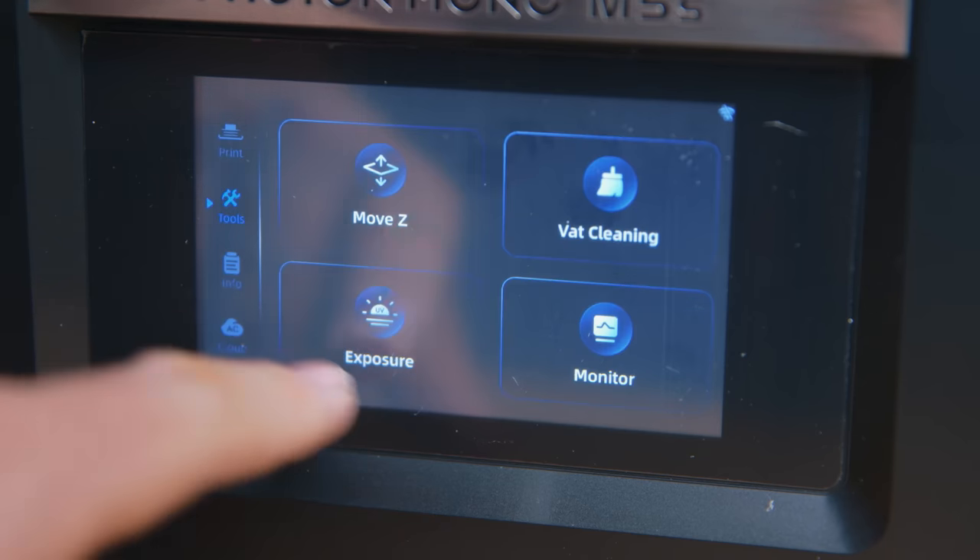Remember, the bigger the things you print, the less visible that slight detail loss is going to be. If you don't care too much and just want fast prints, wade in with either of the premiums — they are both super fast, with the M5S advertising 105mm/hr and the Saturn Ultra advertising 150mm/hr. But to do this you need special high-speed resins and really thick layers. Both brands advertise those speeds but don't tell you what layer height they printed at, what resin they used, or what their exposure times were. Just take those speeds with a pinch of salt — they're both fast.